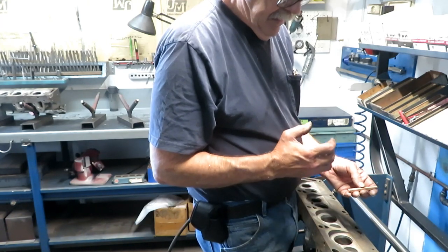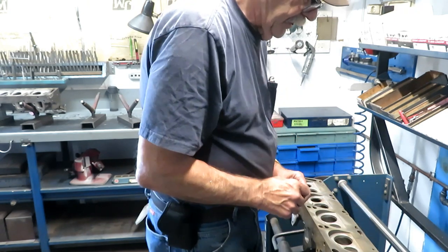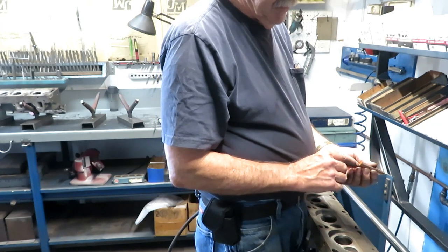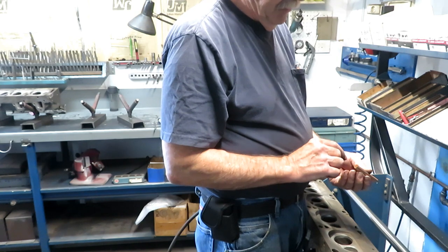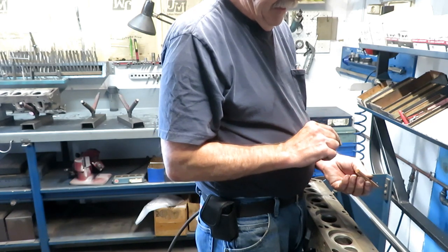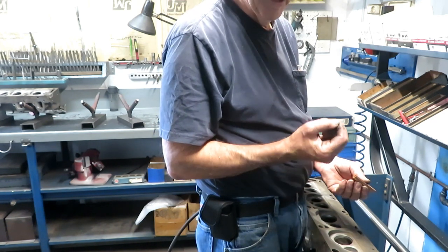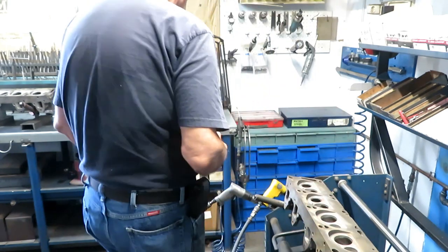And it just really works good, and it's pretty fast. In fact, this stuff, I'll show you, you've got to swedge them to size by stretching them in there. You can't even ream them. You can take a brand new bronze reamer and run it in there with lube, and it'll get about halfway down through there, and it'll start squealing and squawking and seize up, and you drive it out, and there's not a single chip on it. It's amazing how that is.